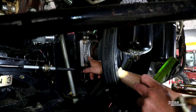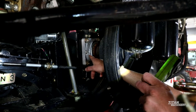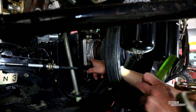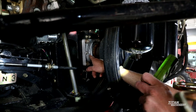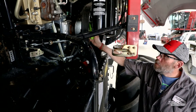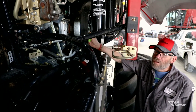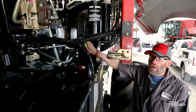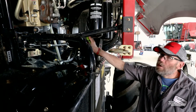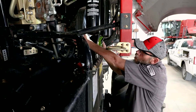You've got your bearings back here on your chopper. If you have the black style bearing, that's the light duty. If you have the silver style like this, that's the heavy duty. You can actually change them over to all this style. They also dropped the grease interval on your chopper bearings from 600 hours down to 100 hours, and they want two pumps every 100 hours on these new style bearings.